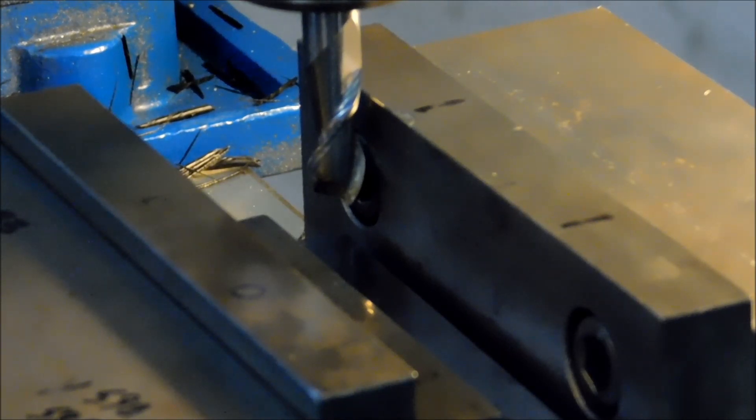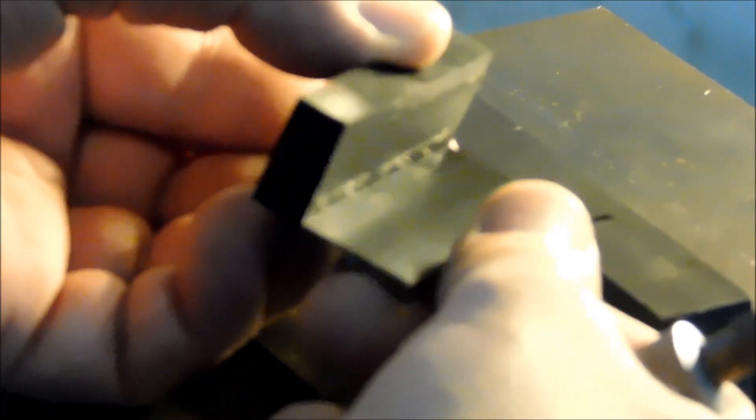You can see the importance of keeping the part buried against the jaw — nice sharp cutter, nice heavy cut. There you go — that is a nice thin piece. We'll measure it up: we've got 22 and a half, 23, 23 at the top, 23 — this is actually closer dimensionally than the eighth-inch piece I just made. Nice clean surface finish — I hope you can see the reflection on that. I would be very pleased with that if that was my finished part. I'll just take it over to the saw, chop it off, and do with it as you please.